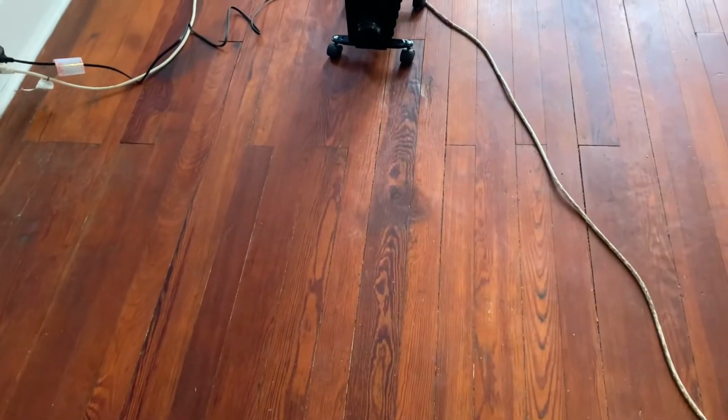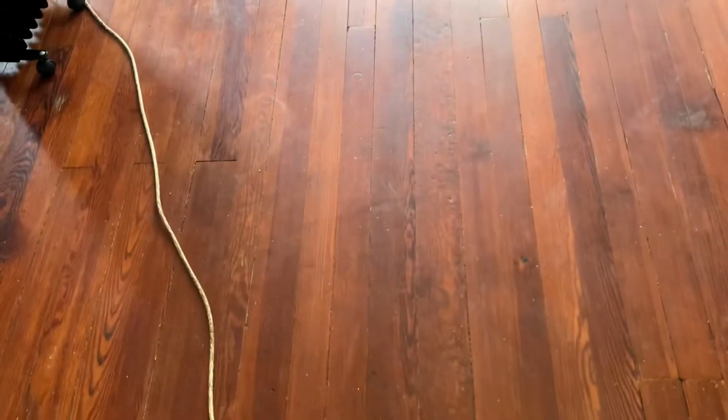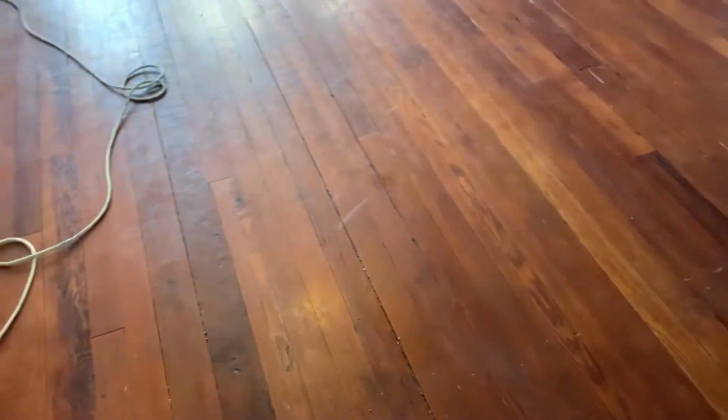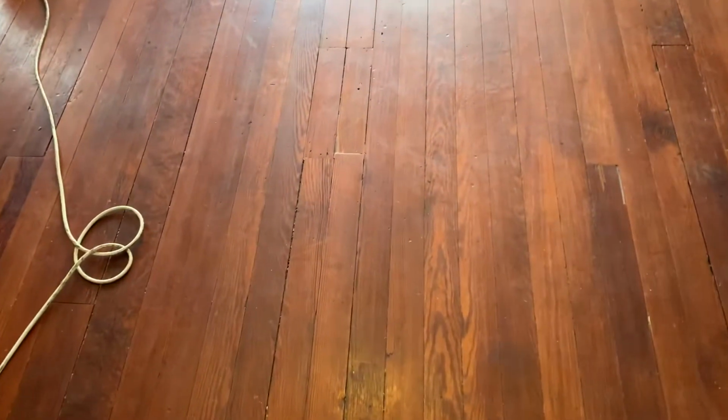It has a very slight sheen to it, and honestly, I was sort of expecting that there would be more shine from buffing. I learned something. The kind of shine I was thinking of comes from what is known as burnishing, and burnishers are very heavy-duty machines, like $1,200, and they give you that glassy shine. All that buffing really does with the wax is it takes off the haziness of the wax. You put the wax on, as it dries it kind of clouds up, and then you buff that away, and there's a slight sheen to it.